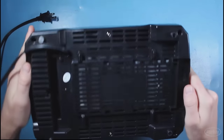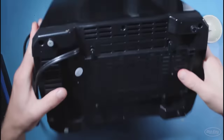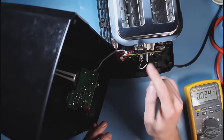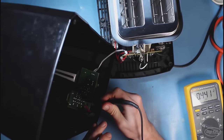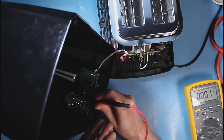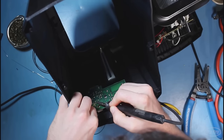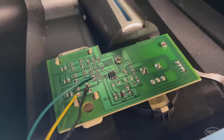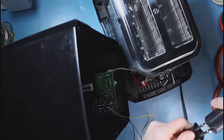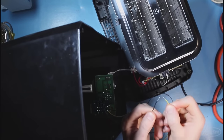Of course, there were a few security screws I needed to get through, probably voiding the warranty in the process, but I don't particularly care because this is an inexpensive toaster purchased exactly for this purpose. Once on the inside, I figured out which electrical nodes control the cancel button, and I wanted to look at the voltage for the LED to see if I could determine when the toaster was toasting. Knowing those, I tack-soldered some wires to it, and those are going to be connected to the WIO terminal so I can programmatically sense when toasting is happening, and of course cancel the process.